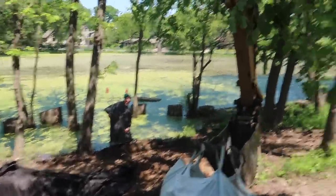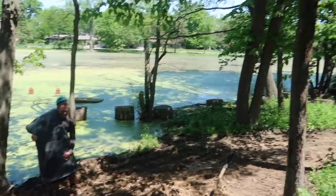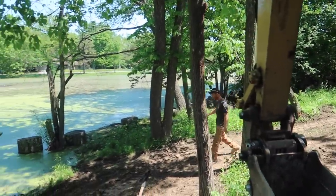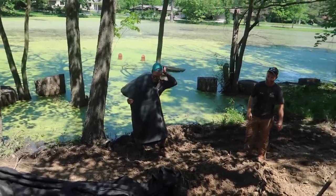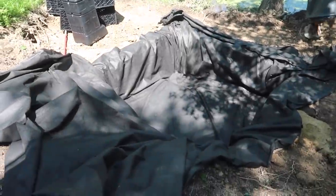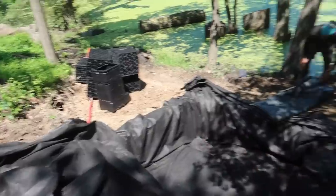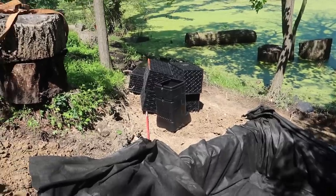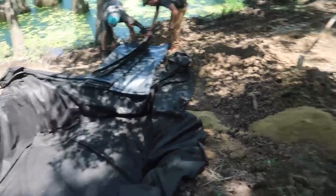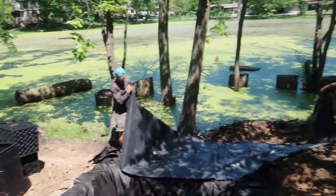We keep Chris around because there's a 20 by 30 foot liner going in this hole, and he's got superhuman strength. Our hole is dug — it's about 11-ish. We've cleared everything out and cut in some ledges. We have our hole excavated for 15 blocks. We'll get those in, liner goes in, and we'll start backfilling with sand. We've already put a layer of sand underneath the underlayment and we'll just keep moving along. Productive day for three guys.